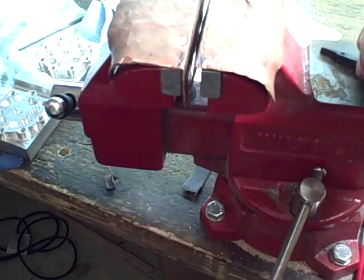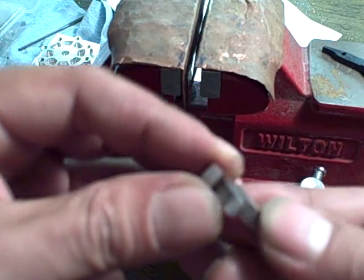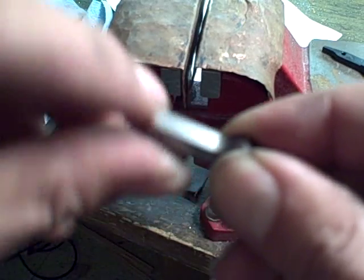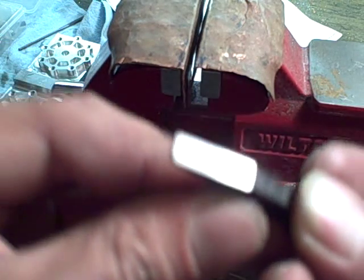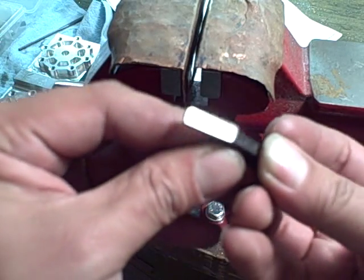I already started polishing on this — the sear. I didn't actually start cutting; basically I'm polishing. I took out as many little burrs and machine marks on that as well. I'm still not done with this — see those little microscopic lines in there? I'm going to take those out; I hope that'll show up on camera.